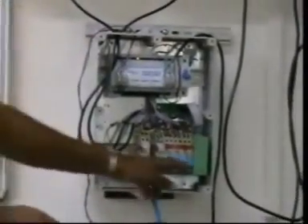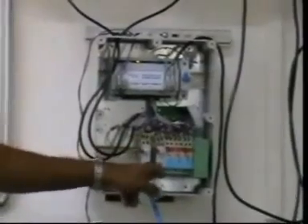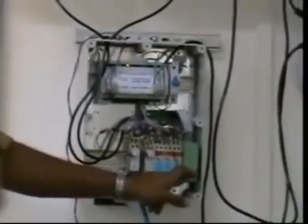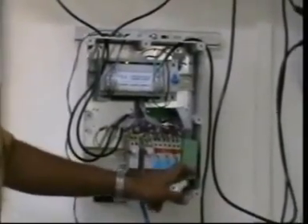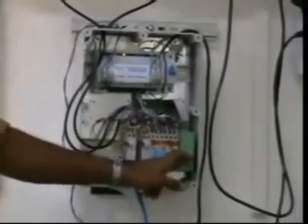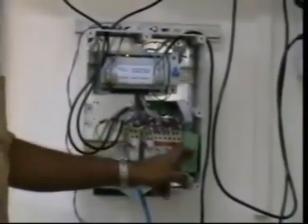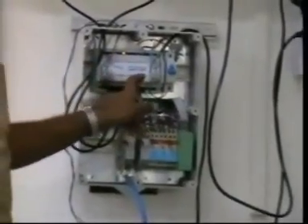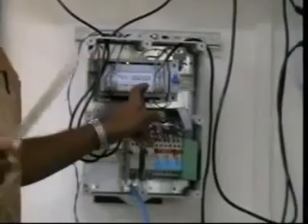The Zener barriers are equal to the number of flows present in the fuel outlet. This is the DIMIS interface — this is an intelligent device. It contains microcontrollers, ASTM table, all conversions, temperature compensation etc. Every information is stored into this. This is the power supply; it has 230V AC input and DC output for the control room.